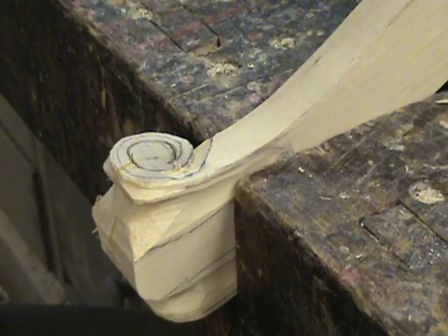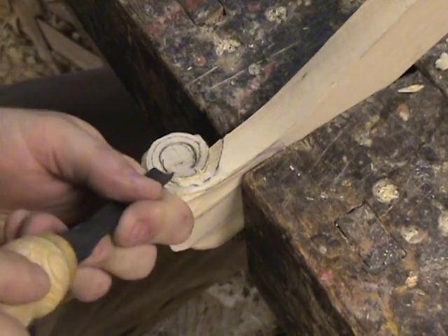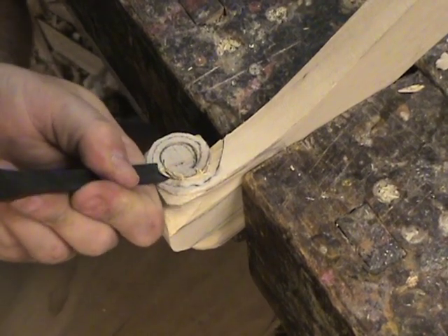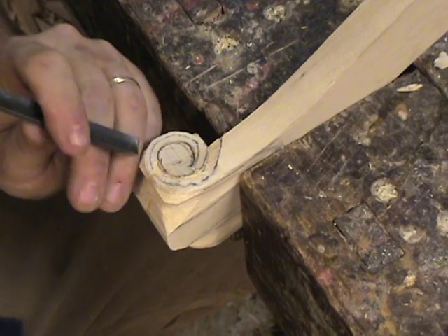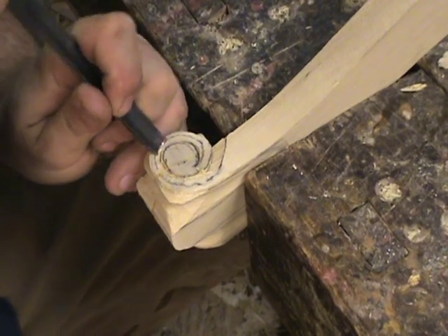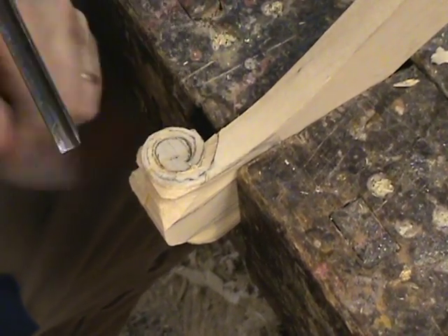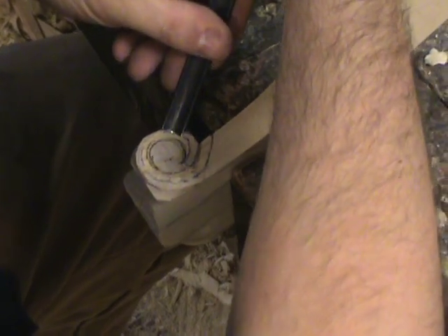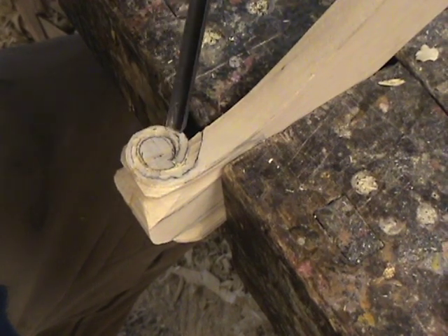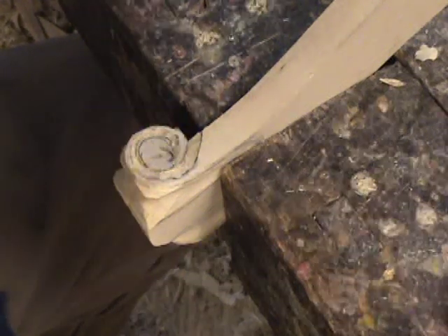All I'm doing is just wiggling it a little bit and pushing, going around until I get it fairly roughed out. You've got to be pretty careful here — I've slipped several times before and ruined the piece and had to start all over again. You hold the chisel at an angle and just go down. It's really not difficult, you just have to be very careful not to slip. That block I glued on the bottom means I'm cutting end grain on this part, which makes it a little more difficult.